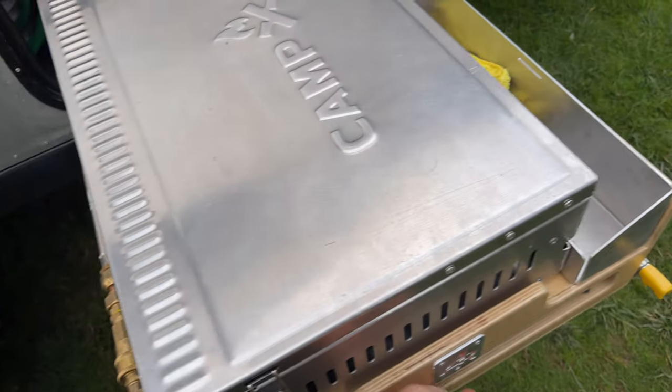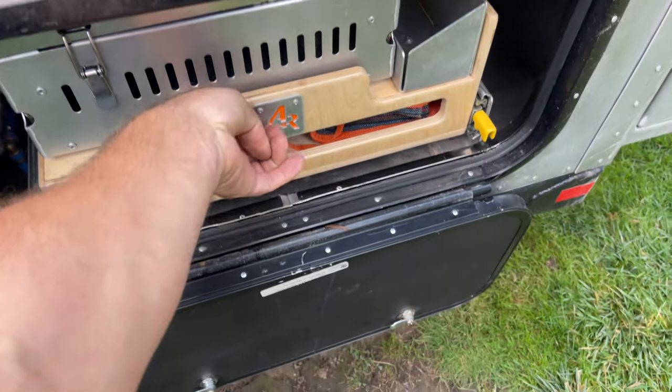All that's happening now is I do this one-handed with a knee for support — boom — my propane is on, everything's working fine. All I have to do is turn on the valve up front in the trailer and this is ready to go. If I don't want propane flowing this way, I just shut this valve off. We're going to go back to the shop and talk about the reasons why I do it this way.